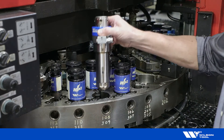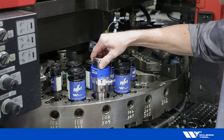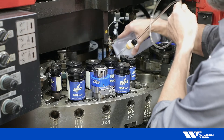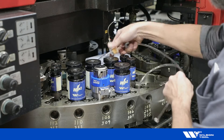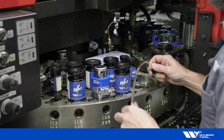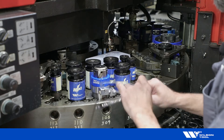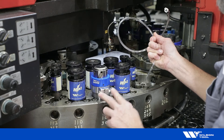When installing our tool into the station, ensure that the tool is resting on the lifter mechanism. Place the tank using the magnetic base in a safe location, free of obstruction. Next, route our oil hose so that it won't be damaged or catch on something during turret rotation. Use the magnetic ring to assist routing. Rotate the clocking ring as needed. Note that the fitting is reversible.